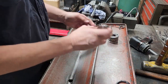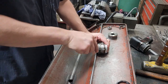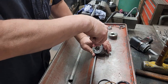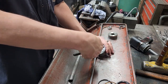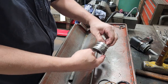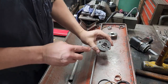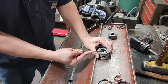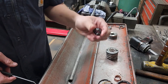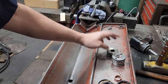I'll set the piston to the side. Now the gland — I'll remove the o-ring and the backup, go inside and remove the rod seal. It just shot off somewhere. That's got a smaller ST wiper. All right, I've got all the seals out. I'm going to go clean up the gland and the piston, get those all cleaned up, and get the new seals ready.